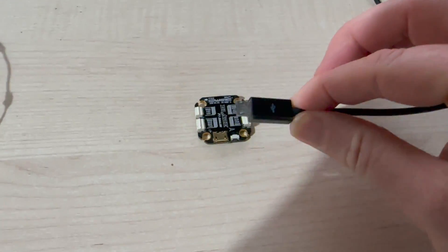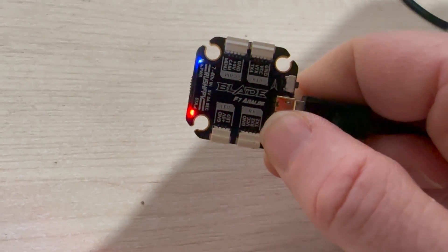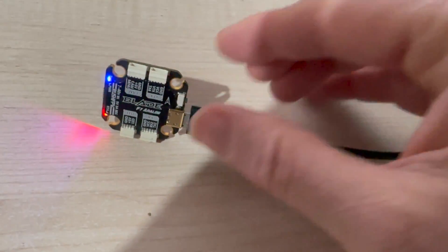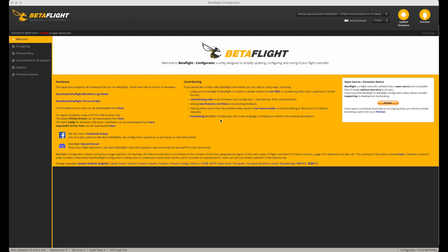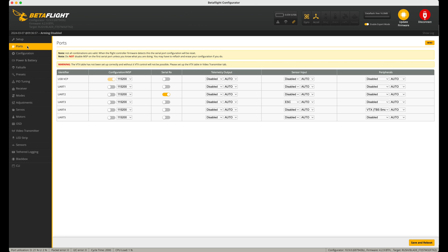I've connected both TX and RX because it certainly can't hurt. Now I need to connect the flight controller to USB to do a quick configuration, remembering which port I need — RX2 TX2, as written on the board. Into Betaflight we go. This board's running Betaflight; if you're running iNav or something else, they're mostly derivatives so it probably doesn't make a difference. The only very different one is ArduPilot. This is about setting up MAVLink — people think MAVLink only happens on ArduPilot, but you can actually set up MAVLink on Betaflight, iNav, pretty much anything we fly, and this is important because MAVLink is the telemetry that OpenIPC speaks.